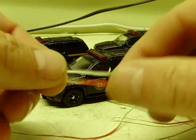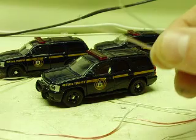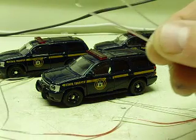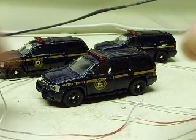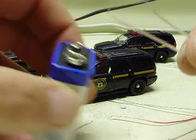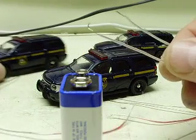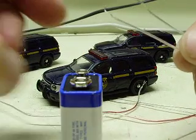Your red wire, obviously, will go to your positive side. I've got these set up to run on 9 volts. They should operate safely all the way up to 12, but I wouldn't push it. 9 is optimal. Getting up to 12, you're kind of pushing max on them. So try to run them closer to 9 if you can.